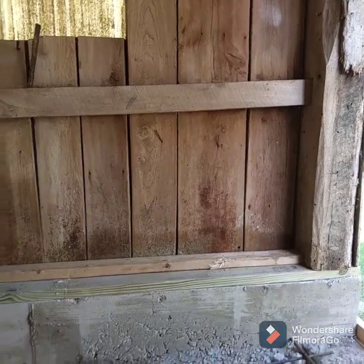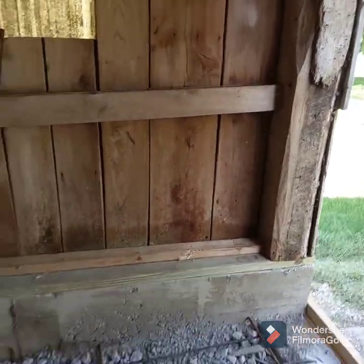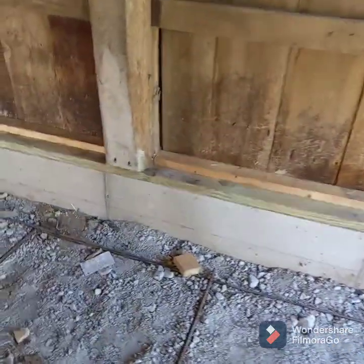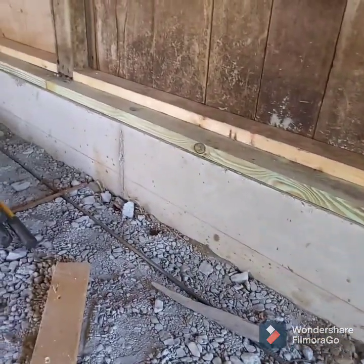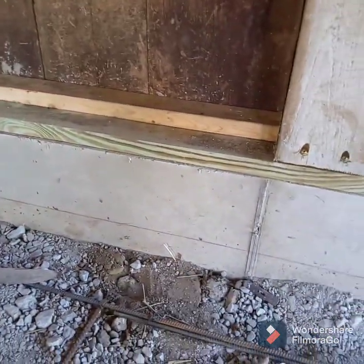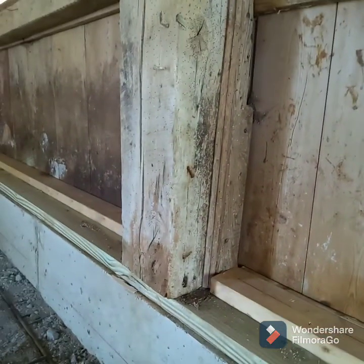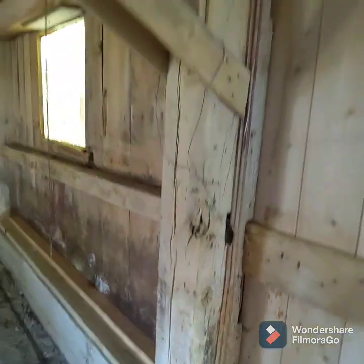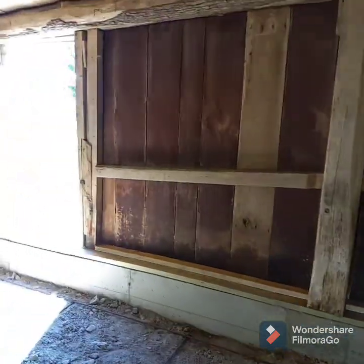So instead of tearing them down, here's what we did. On the opposite side of the building, same kind of corner post, but we actually jacked this whole building up and hand dug underneath about three feet deep, put a trench footer in the ground, then formed up a wall and put a new sill plate right there, then lowered it back down off the jacks — honestly giving this building another 120 years.